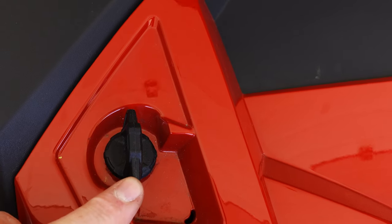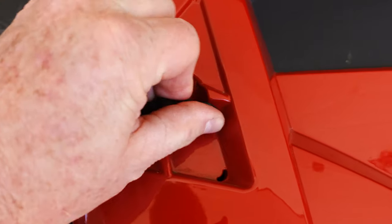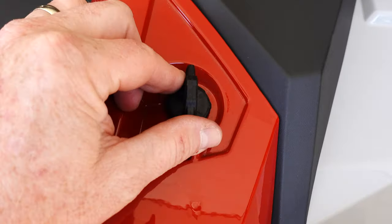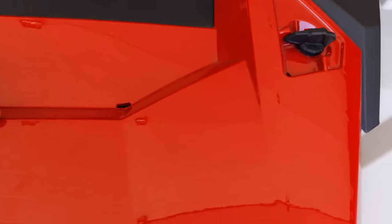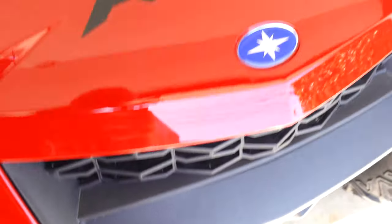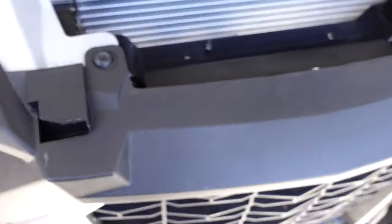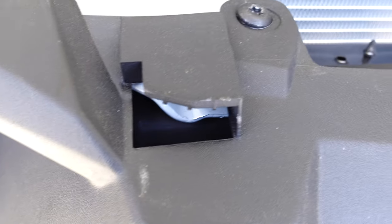You can see with this mold here you can only go one way, so this is locked. What you want to do to unlock it is just turn it this way, and do the same thing with the other one. Now it's unlocked. Then kind of lift up slightly on the back, jimmy it forward — and now you can see that little female slip joint there.